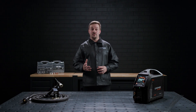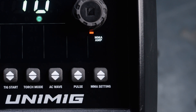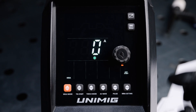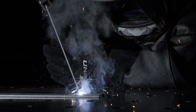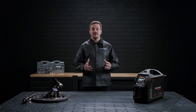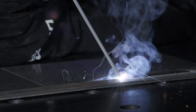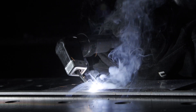To select your MMA settings while stick welding, use the up-down arrow to cycle through the MMA amp, hot start and arc force. The MMA amp setting lets you adjust your welding amperage while stick welding. The hot start setting lets you adjust your hot start from 0 to 80 amps for a boost of amperage at the beginning of the weld to help with arc ignition. The arc force setting lets you adjust your arc force from 0 to 40 amps for a boost of amperage to ensure optimum arc performance. The anti-stick function is on by default, which helps stop welding electrodes from sticking to the workpiece.